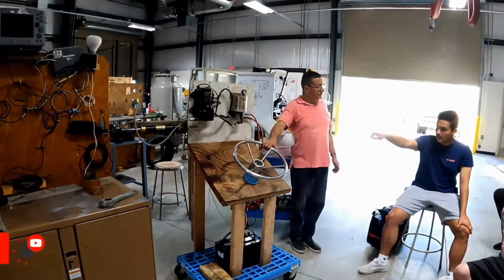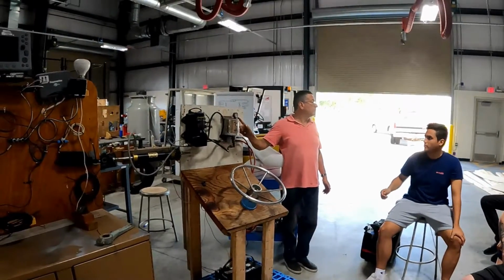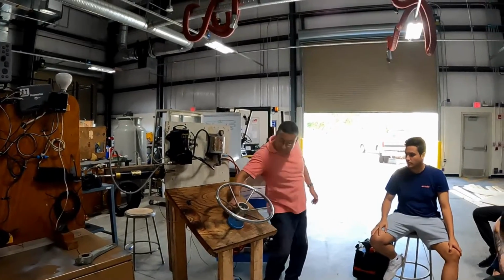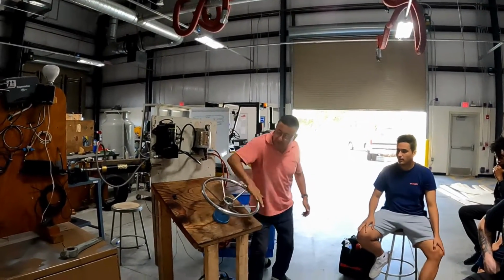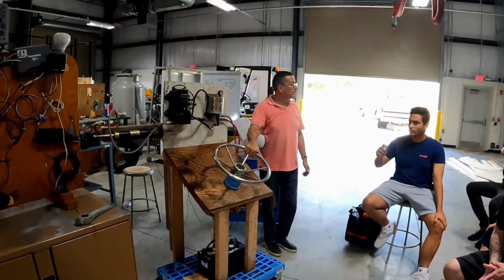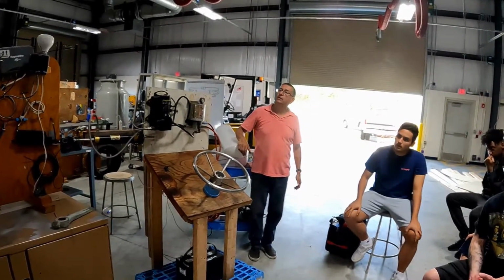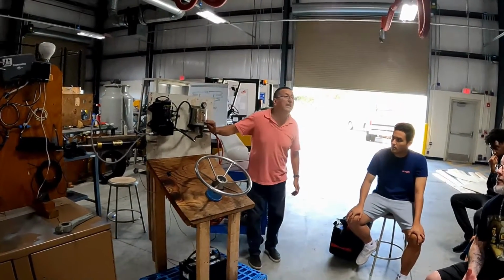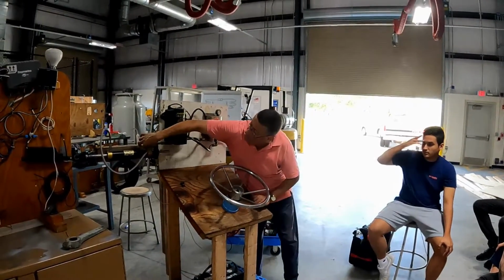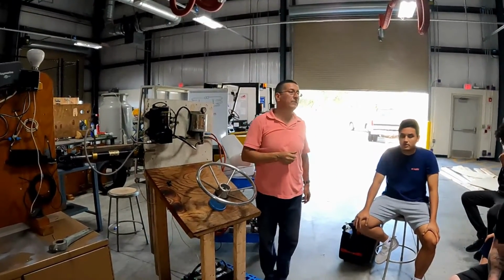You said you can bleed them at the actuator or here. Let's say you don't have to do it both, though, right? No, just from one or the other. You can bleed here also. Okay, now the other direction. And then after you bleed, you have to repressure with the hand pump. In some cases, yes. You may bleed it out so much you have to add pressure to keep bleeding, and additionally add fluid, because when you bleed the oil here, the air is going with the fluid.